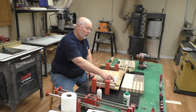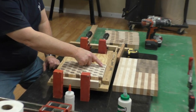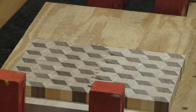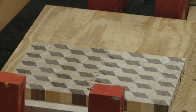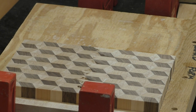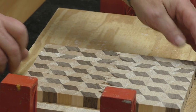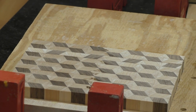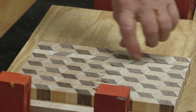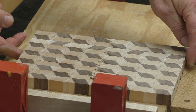If you look, all the walnut is going down to the left and the cherry is going down to the right. Voice of experience: make sure you check everything before you glue, because I have messed up and didn't catch it until I glued it. In order to salvage the board, I ended up cutting that piece out. So I was able to salvage it, but it's a pain when that happens.